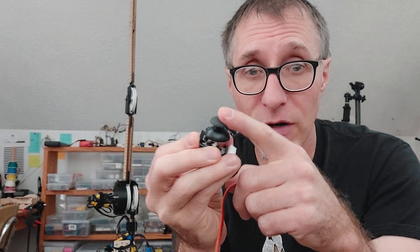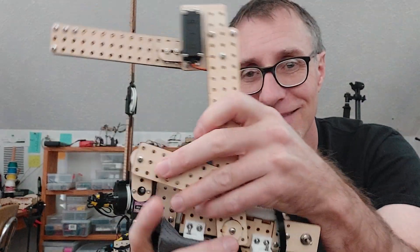You work with what you got. Standard hobby servo - this is actually an analog servo, but I tend to use digital servos for a lot of these things. Standard joystick on a little circuit board - they sell this, they call it a PS2 joystick, but it's just a basic analog joystick. It does have a click, but I tend not to use that. Usually I'm just using the X and Y, especially for things like this. It's a wearable with a first arm section and second arm section - not exactly an intuitive interface. It's like a poor UX choice, but I like it, it's kind of just derpy enough.